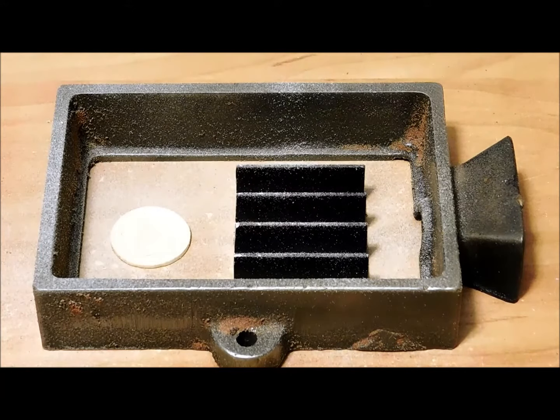The aluminum, since it's a lot less dense than copper or silver especially, there's not as much pressure pushing down into all those little spaces, just because it doesn't weigh as much for the same volume. That can be a problem with casting smaller details. And I'm not 100% sure if this heat sink will work out okay or not, but I guess I'll find out. I know the coin will, because I've done one of those before, even in aluminum, just wasn't recorded before.